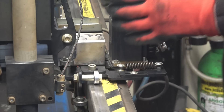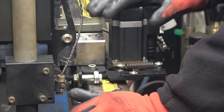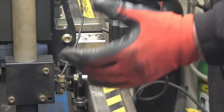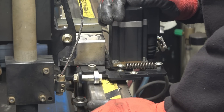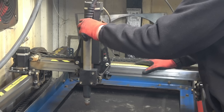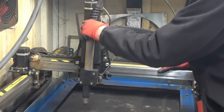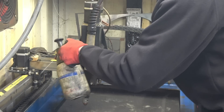The tables have all changed again — the new black ones are different again. Same principle, they're just built a lot stronger and stiffer. Rob has obviously learned as the design has progressed because it's constantly changing. The torch is mounted on what we'd call a friction device, so if you crash it, it just bends out of the way without causing any damage. It's so simple but it just works.